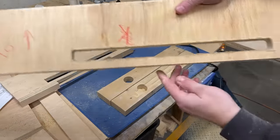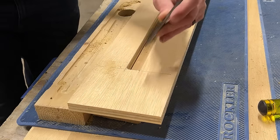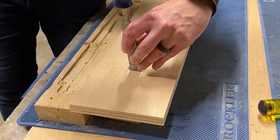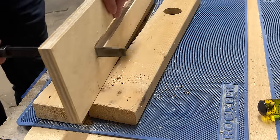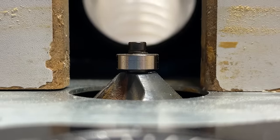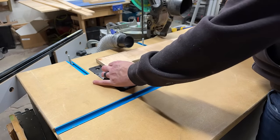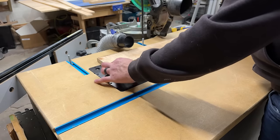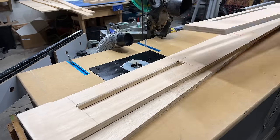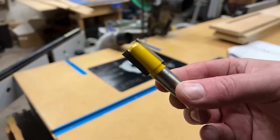Nice and clean — needs a little sanding, but it's all straight. I went ahead and squared up those edges; after the fact I realized that's unnecessary — the round works perfectly well. Then there's a chamfer bit, and we're going to run it on the inside of that new hole on both sides and along the bottom of each of those pieces. And there are our four sides. The slots are in two different locations depending on the side of the table — the long sides have it in one area, the short sides in another — that's why I had to make two different templates.